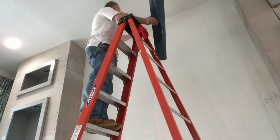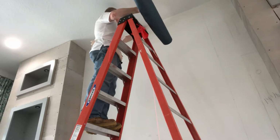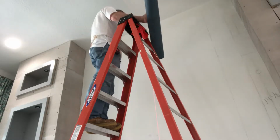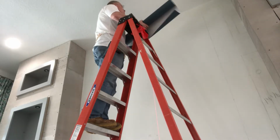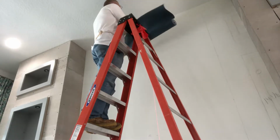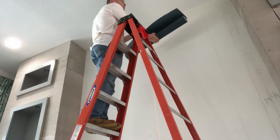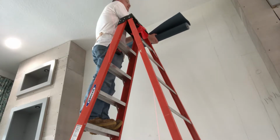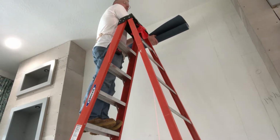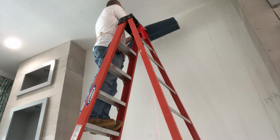Blocking the red line, of course. Okay, there it is. There's another problem when you actually have a laser behind you. You will block the line, so you have to come up with ways. What I do is I run a strip of tape from the side, so I'm not blocking it. And then I simulate my laser line. I shut the laser line off and I have it in tape, because I put the edge of the tape up against the laser line.